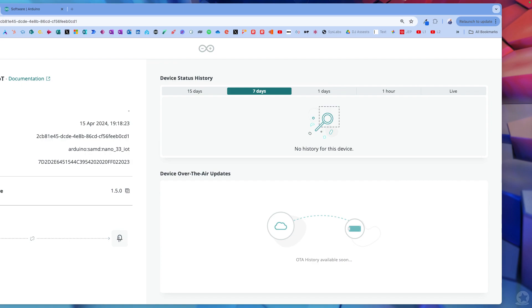You can have lots of different variable types: character, floating point, or integer. In C++, it's really about whether you want a decimal - that's a float - or just a whole number, which would be an integer. For Alexa compatible, you're more often than not going with a basic type or Alexa compatible, and mostly it's just true or false. The only reason you might want to choose 'light' over 'motion sensor' is for when you're searching on the Alexa app - it tells Alexa what type of device it is. I'm going to say 'light' because I'm going to do an LED, and this is going to declare the variable. We want read and write, then add the variable.